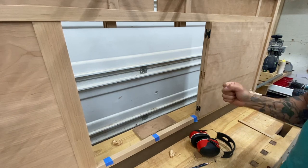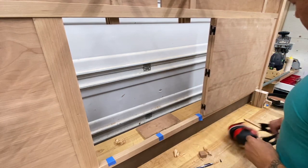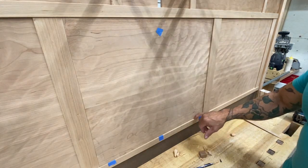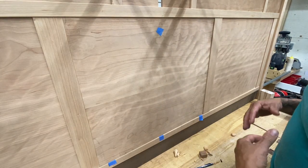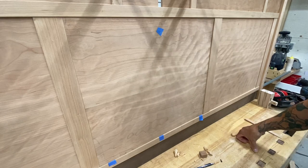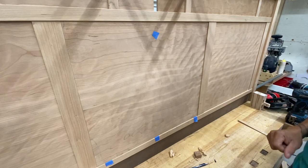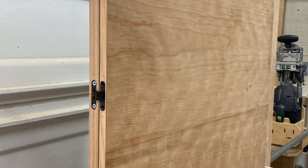This is testament to a good layout using those center marks and keeping that handle on the router oriented the same direction — it's going to ensure that everything lines up. I've added two pieces of tape down at the bottom so that's the amount of gap it'll have. I need to allow a little bit for lacquer as well — the inside of the frame will have lacquer, the edge of the door will have lacquer, those few mils add up. I'll probably lacquer the footboard and then fit the door and plane a little bit off, just to sneak up on an absolute perfect fit.